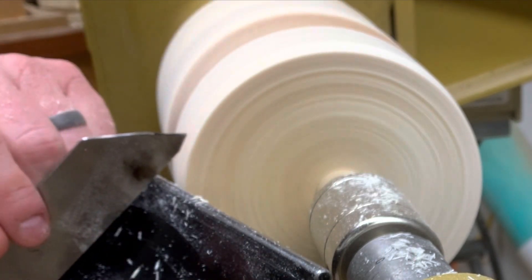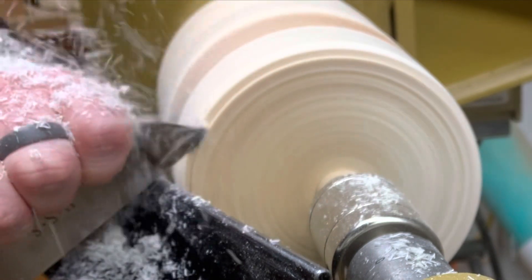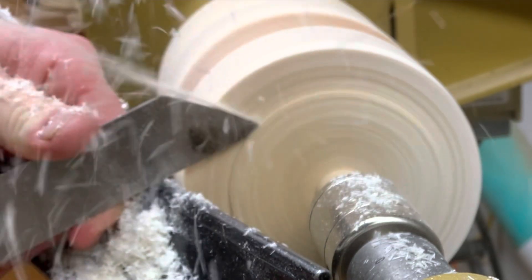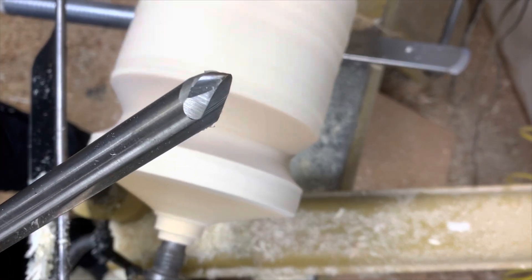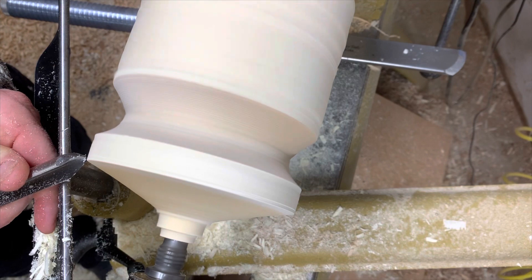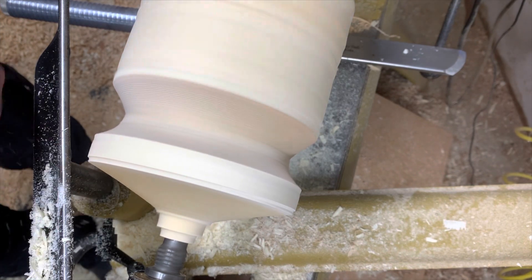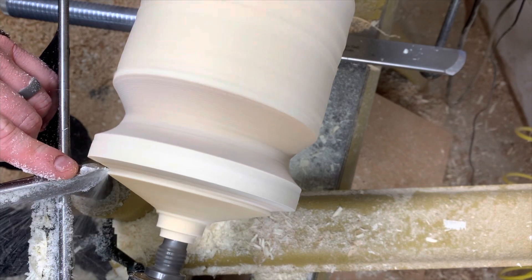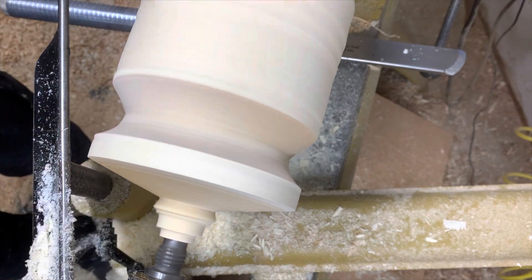Here's a different parting tool. On this one you don't have to have a bevel, but I just did it to make it easier to sharpen. I'm pressing against the tool rest — rubbing the bevel, you can see right on the bevel. Now a 40/40 grind bowl gouge. There's no bevel right here to rub yet until you get it established. Once I've got that little lip, I can rub it and chase that in — rubbing right behind, cutting with the grain, rubbing the bevel.